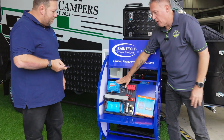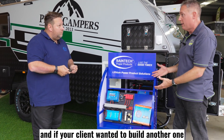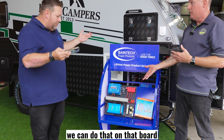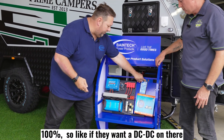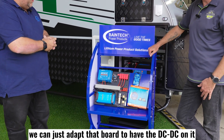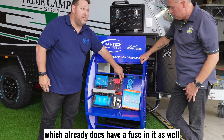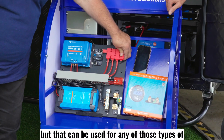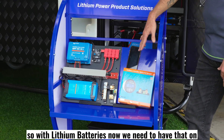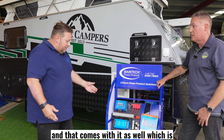We're still putting the solar MPPT — your 30-amp one — and your 30-amp AC-to-DC. If your client wanted to add a DC-to-DC charger, we can do that on that board. There is actually a spare fuse block here, which already does have a fuse in it as well, and that can be used for any of those types of extra add-on devices. We've also got the BMV, so with lithium batteries, we need to have that on so you can monitor your battery system — and that comes with it as well.